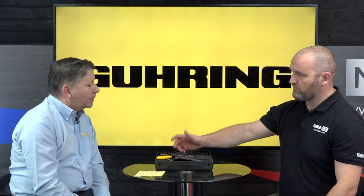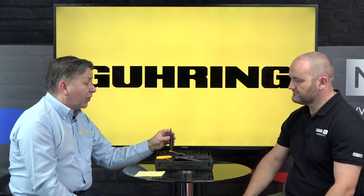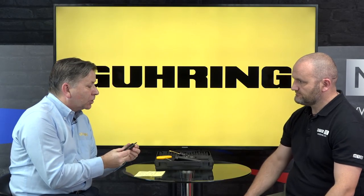You're absolutely right, when you're doing internal grooving or boring, evacuating that swarf in the machine environment is something you've got to do. So do you think it's better doing it through the sleeve, the tool holder, rather than the actual bar itself? Absolutely. A lot of work has been done on this by our R&D. I've seen it out in the field, and the amount of coolant you get through these holes is fantastic. You don't get this bird's nesting swarf issue, particularly on small bores. I think it's an important feature of this tool.